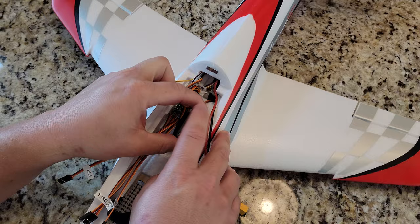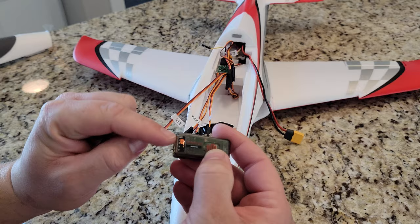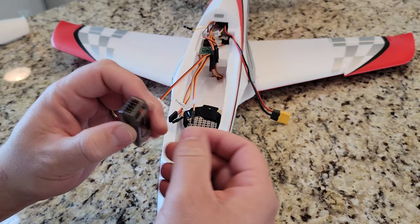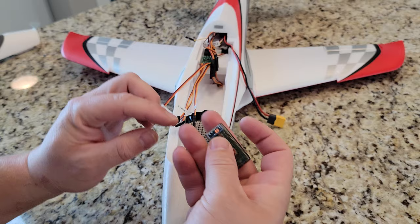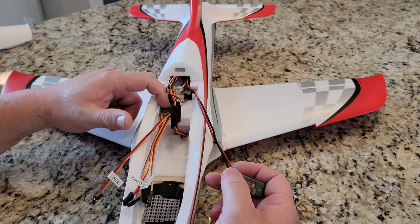All right. So this is the AR410. It's four channels. There's a battery connection, then there's 1, 2, 3, 4. That is not a bind port. There's a bind button. Once you bind, you force bind mode until it binds or you de-energize it. So in our case, it's gonna be very easy. And by the way, you don't have to plug in a battery plug because each and every one of these connections will be common with the plus and minus DC voltage through the vector flight controller and stabilizer.